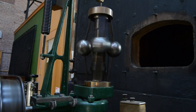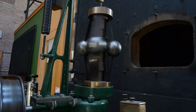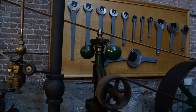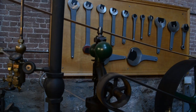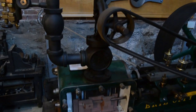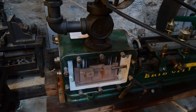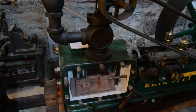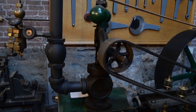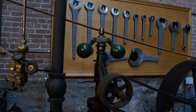The utilization of a governor became crucial in the operation of large engines and machinery during the Industrial Revolution, and long since. If an engine is allowed to run too vigorously, it runs the risk of shaking itself apart. Furthermore, in large factories where a multitude of identical machines were configured to run off of a single engine — such as the power looms in a textile mill — a constant, steady, and stable speed had to be maintained at all times, or the work produced would be irregular.